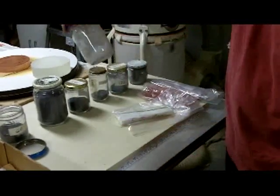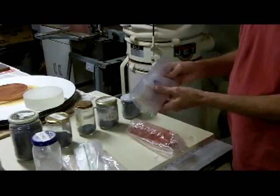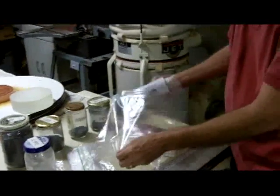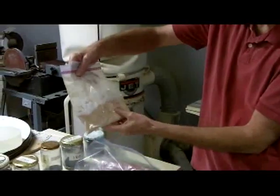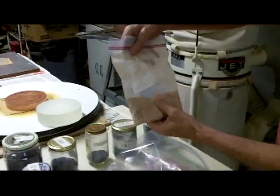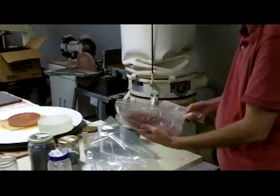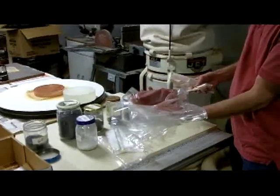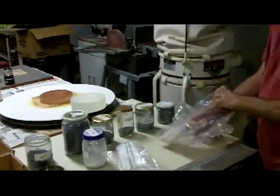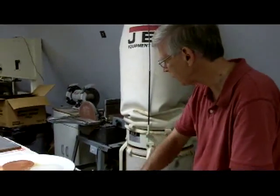And then once you finish with the 5 micron, most people go to a polishing compound called cerium oxide, which looks a lot like the white powder, but it's a little finer and it works a little differently. And it takes a special tool to apply this with. And some people like to use optical rouge, which is the red stuff, which used to be the only thing they had, but which is just another fine powder. But I've been told that you don't have to use that stuff.